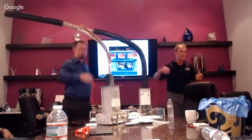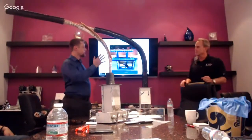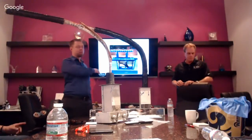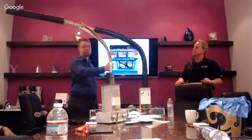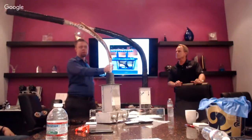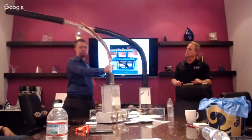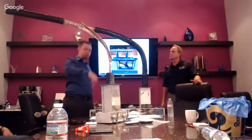Yeah. What he said. So if someone gets sloppy in the connection, or if there's issues going on with the bar wall or the bar top, and someone were to come in and not do a good job making the connection because of space constraints or something, a 10-inch gap, a foot, 2 feet, something that's not touching the refrigerated lines, if that sits and it's not in use, it will foam up. And then when the bartender opens the faucet, something will pump through this area. Eventually it'll pop foam in their glass. They won't know what's happening.